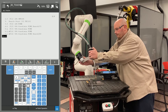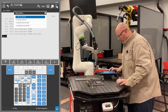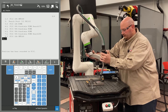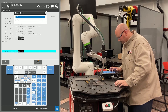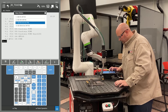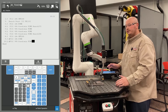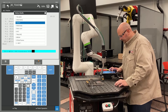Now I'm going to search in my Z direction. I'm going to bring the robot up to a location that's safe and away from my part and record that point. Then I'll bring the robot into a position to perform my Z direction search. I'm going to record this point as a J motion with a fine termination, and then record another point in the exact same location as an L motion with a fine termination. I'll change the position ID numbers to match so it's the same location as the approach. You need two points in the same location — one to get there and one to search from there. Now I'm going to tell the robot to search in the minus Z direction.